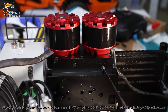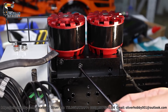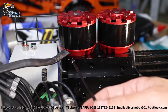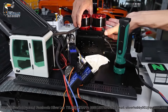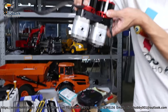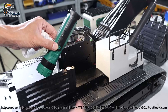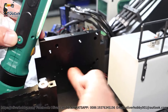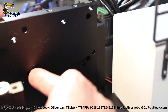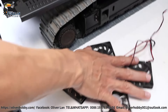That's the power oil supply to these two valve blocks for the front arm and bucket. You will see inside this position, the valve block on the right side — that's for the big arm, oil supplied by the rear side pump. This side is the return line, going through for all three valves. This is the inlet for the big arm; that's the inlet for the front arm and the bucket. Now let's remove this one.